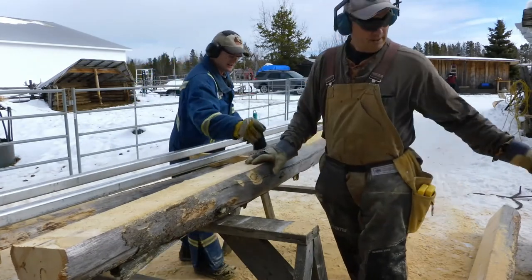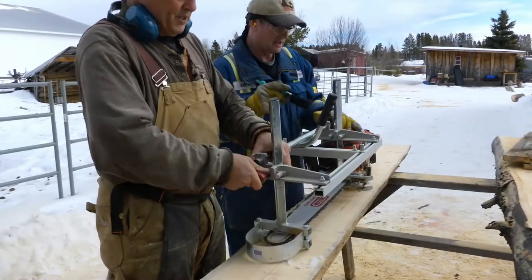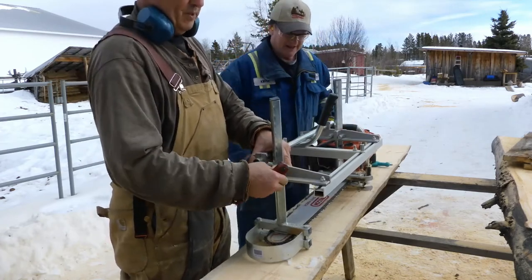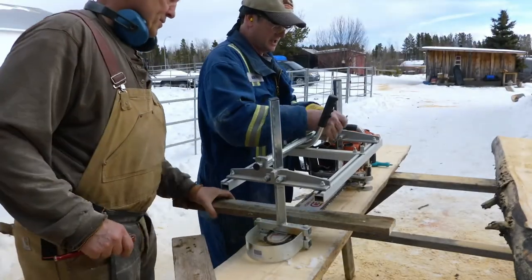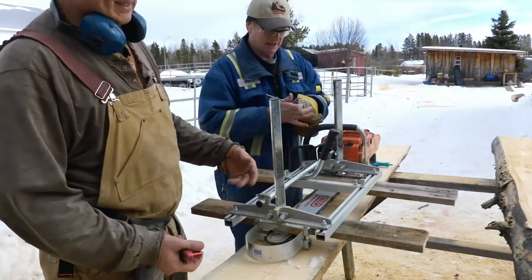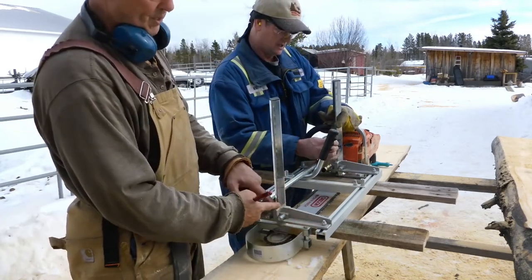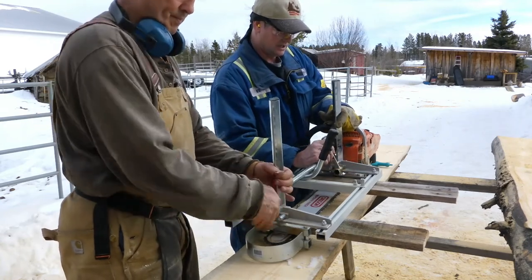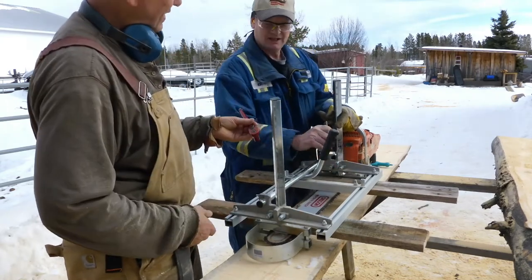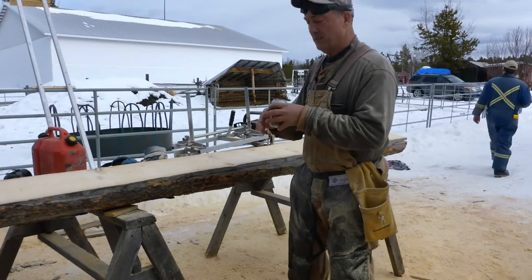So we're gonna swap the mill around to do the inch boards. That's pretty. I do have to say, after using this for a day, I like this Powerfist mill. It's pretty simple to use. Yeah, and it's really quick to set up once you've played with it a couple of days. So there it is. Just drop her down, and there that sets your board thickness, right? Fire up. It's square, and it comes right into that V. When you tighten it up, it squares itself right up every time without jigging around. Want to use the ratchet? Done. Gear brake. Necessary part of this operation.